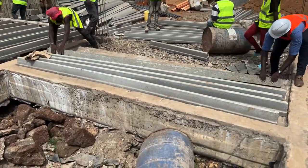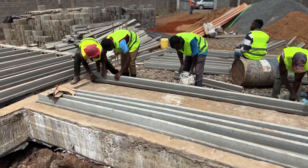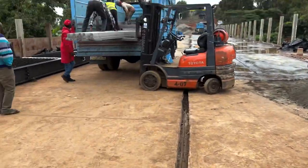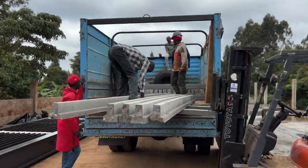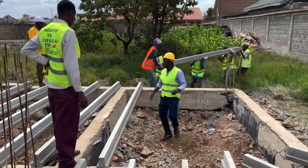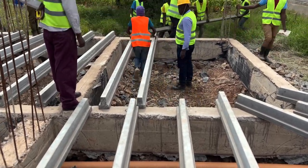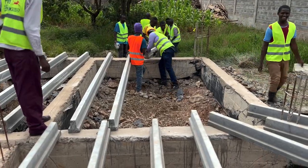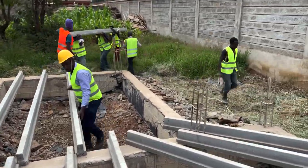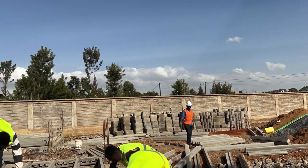As you can see, my ground beams are ready to receive my pre-stressed T beams. It's a very easy concept that requires unskilled laborers to lay the beams and assemble the blocks into place. From the factory we produce the pre-stressed T beams customized to suit your drawing — we come and measure, and by the time we're doing production we already know which beam and what size is required where, and we issue an installation drawing.